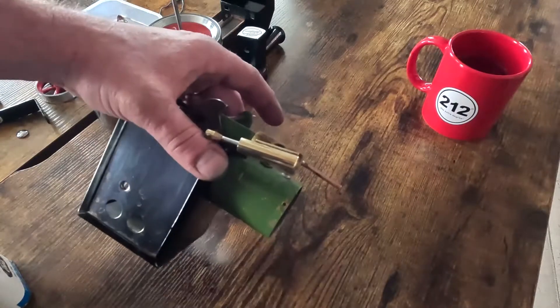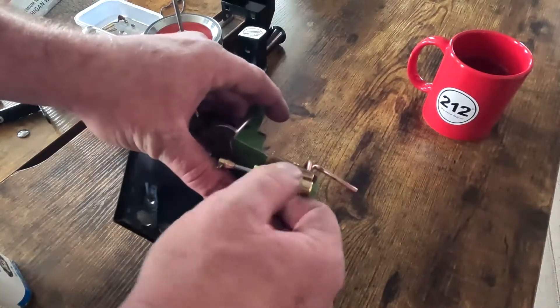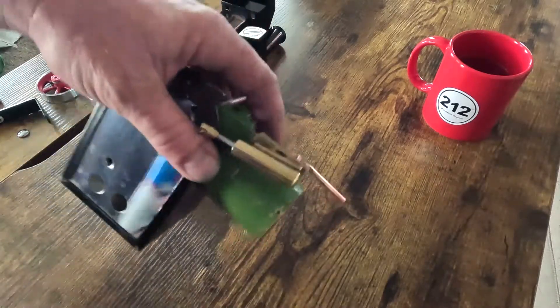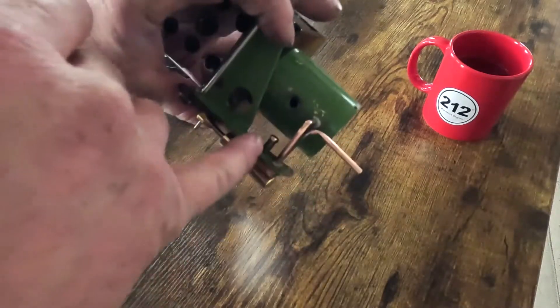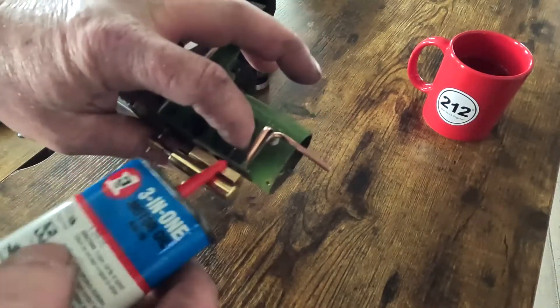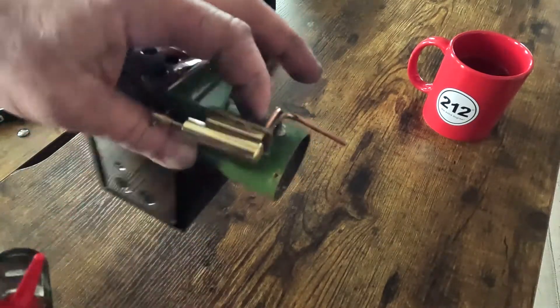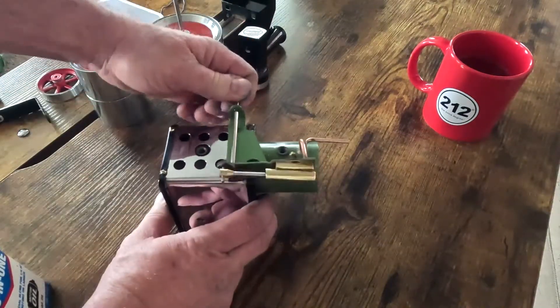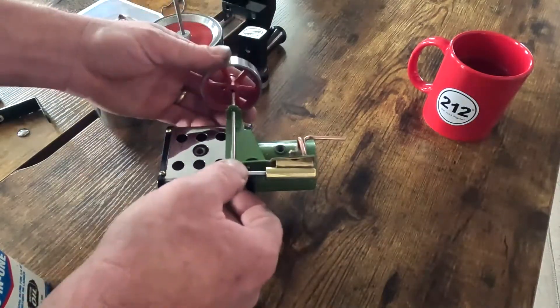Since the cylinder oscillates back and forth right here, we'll put a couple drops of oil on that. There's a spring-loaded bolt that holds the cylinder up against that valve block. We've got some oil on everything and we'll put the flywheel back on.